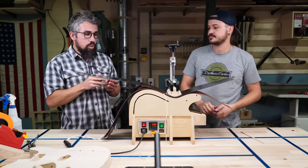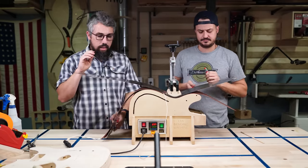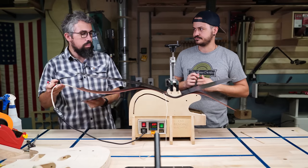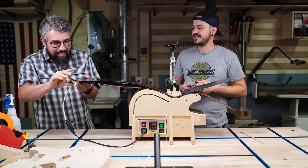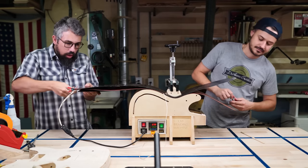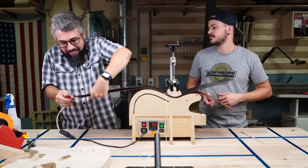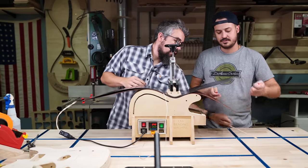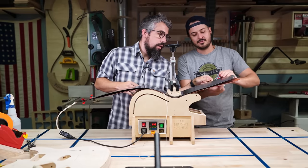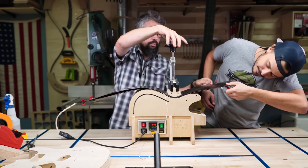Something I like to do is use these little gator clamps — we get them from StewMac, link in the description, or at your local hardware store. I clamp these up so I can go ahead and start preheating this piece of wood, pre-heating that section before we do the main bend. Work smarter, not harder.